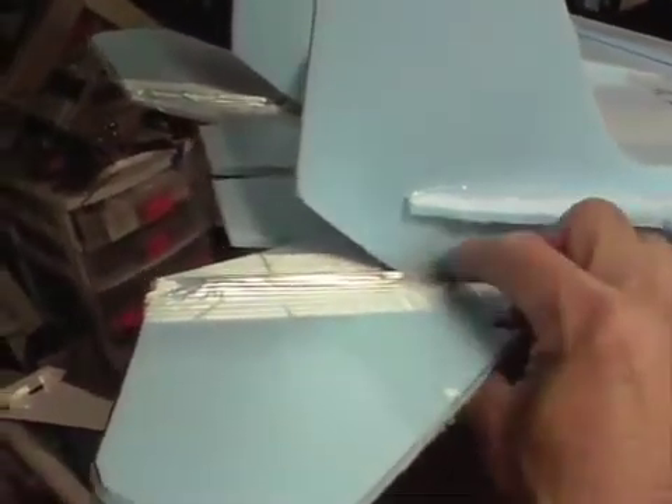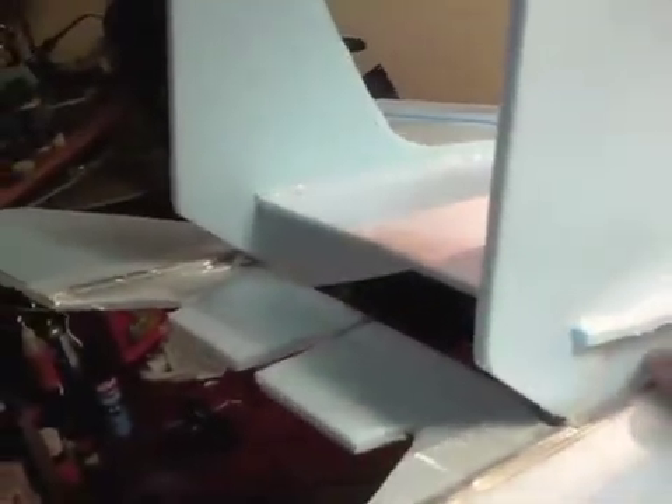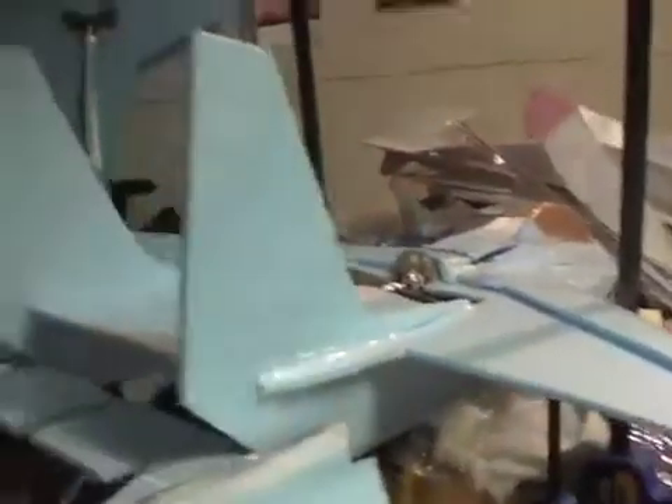I had been flying my F-15 too, and it has a very similar setup with elevons. I had not been experiencing any flexing problems until I had a couple of minor scrapes coming in to land and bent them down — but once they start to bend, it's a problem. These aren't nearly as long as on that F-14; there's about five inches on the F-14 versus just a couple here, but even that little bit started causing problems. So I used a 3mm here rather than a 2mm, because the 2mm just had too much flexion. That fixed the problem.